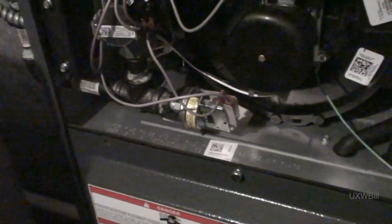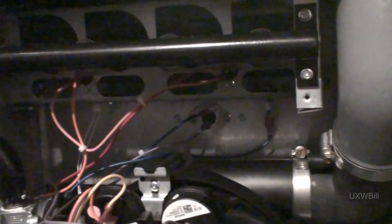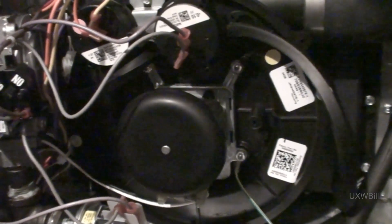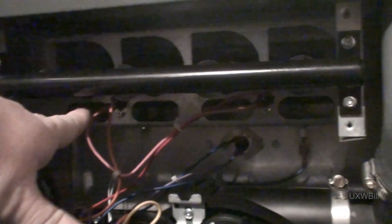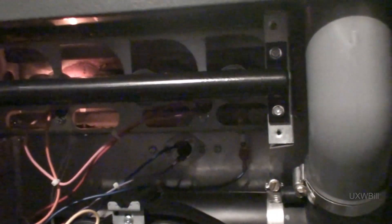That is to say it failed to ignite. So I've gone ahead and popped the cover off here — this is certainly interesting. Looks like there's a pressure transducer on the gas line; I've never seen that done before. That might throw a wrinkle into the diagnosis. But we should have a call for heat at the thermostat, so now I've turned the power back on. Our draft inducer should start just as soon as the board in the bottom portion of the furnace initializes. We'll have our pre-purge to remove any gas or unwanted materials from the burner area before the thing attempts a trial for ignition. There's our glow igniter over there, and our limit and rollout switches in this area — those protect the furnace in case the fire comes funneling out of the burner area. That looks kind of dirty in there; honestly, that thing may need a good cleaning. And over there is our flame sensing rod.